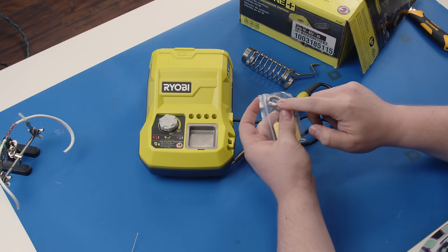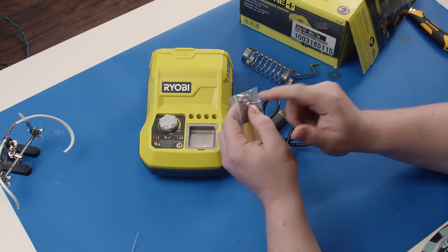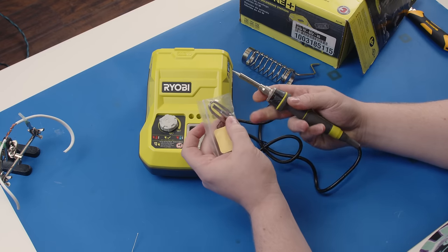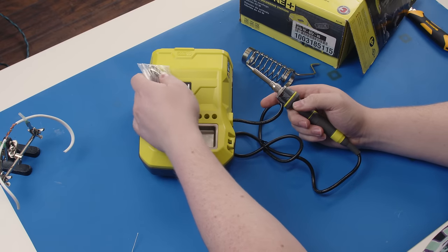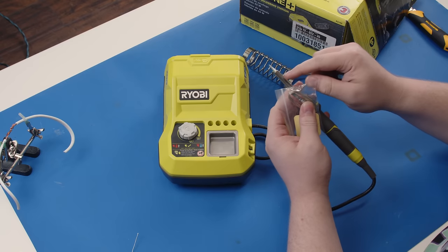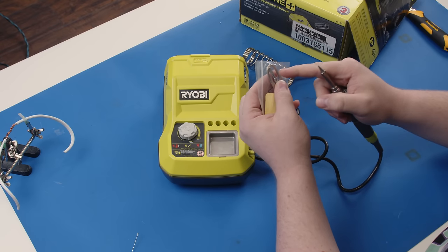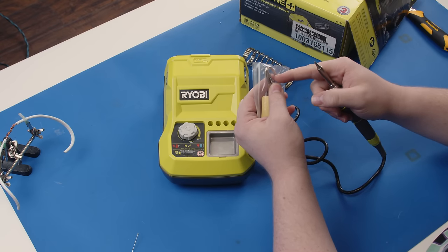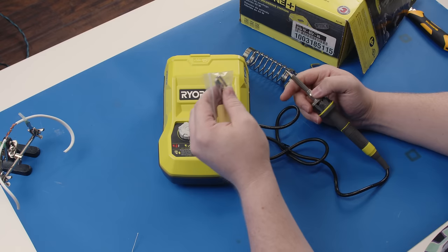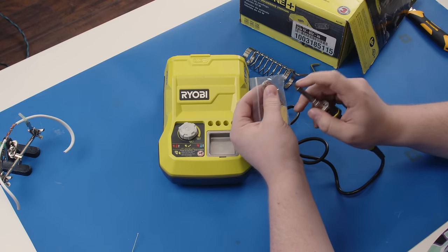This one is a great big, massive screwdriver tip. One of the biggest soldering tips I've ever seen. And that actually makes a lot of sense, because the one in the iron is a fairly fine precision point. And this really represents the two kinds of work you're likely to do with a tool of convenience like this. You're either going to go touch up one or two reasonable little joints on like a printed circuit board somewhere, or you're going to attempt some ridiculous joint in a washing machine or like an automotive wiring harness that you really shouldn't be trying to mess with at all, but you're impatient, you're trying to save yourself from a 6-hour or a 3-day wait, and you're just going to go for it anyway. So these really fit the bill.